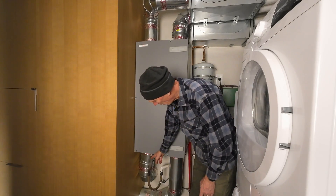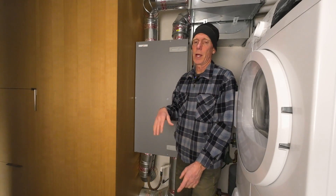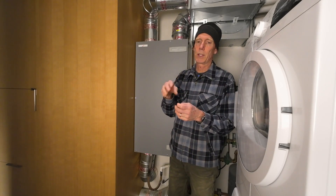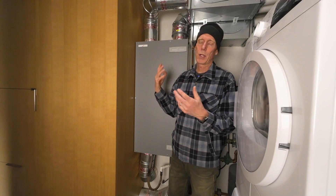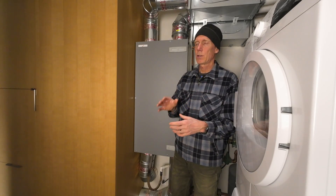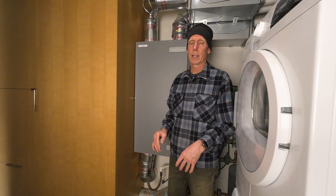There's a drain trap here that is just a drain loop, and then it goes out and dumps into a drain. I keep an eye on that — that's in my garage sink — and I make sure that it's dripping when it's moist out or when it's cold out. That indicates to me that it isn't plugged or anything wrong. So typically you want to check that tube and make sure that it's flowing.